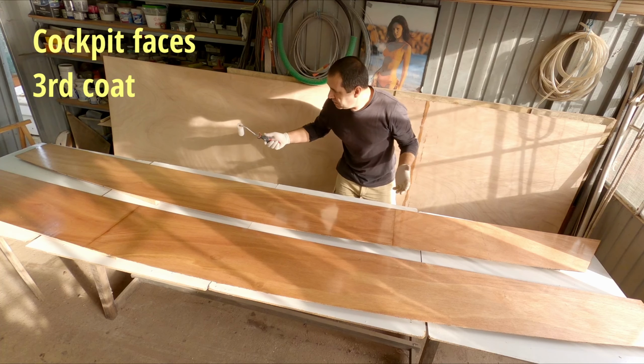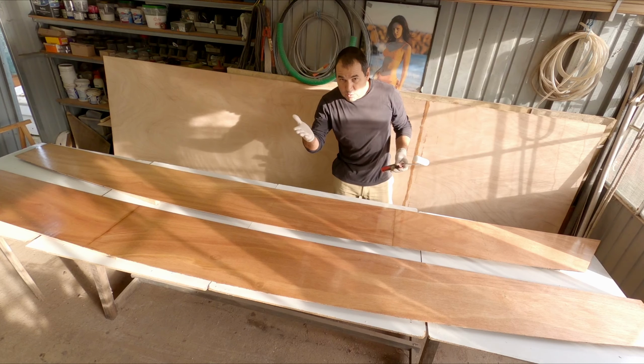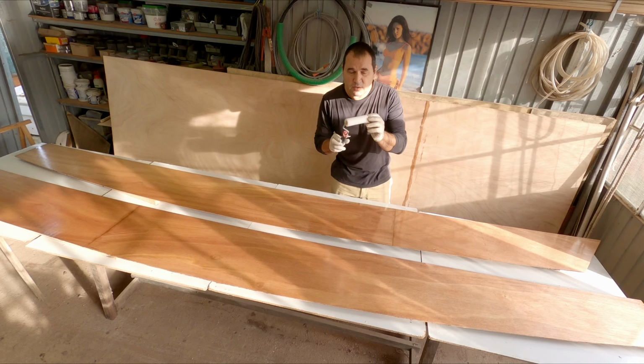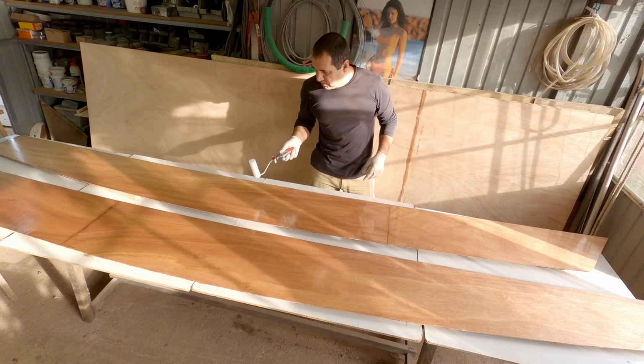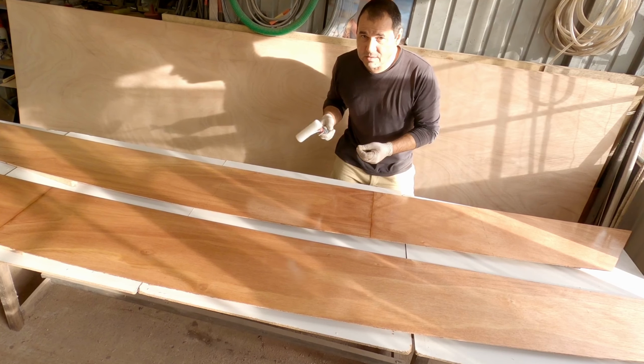But when all the epoxy is spread and you've taken the excess epoxy out with the squeegee, then you roll it, and in the end you drag the roll so it will break all the tiny bubbles that the foam might leave in the epoxy. That will minimize that orange peel effect.